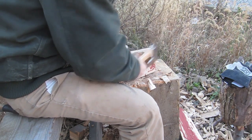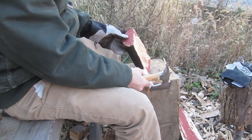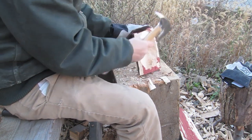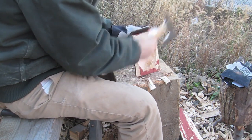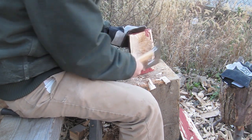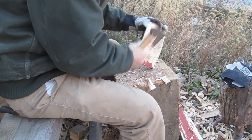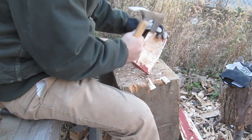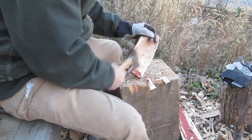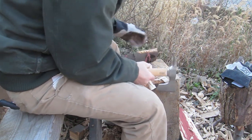Now I've gotten some of the bowl work done and I'm going back to the edge to get the paint off. There's usually going to be something rough from the split or your cut, and also because it was a little bit curved I'm flattening it out completely now. You do that after you do the bowl because there's much less material to flatten — there's only a few inches on each side.